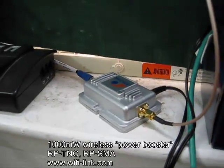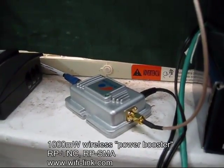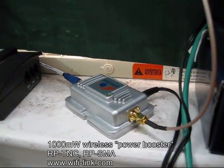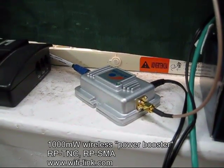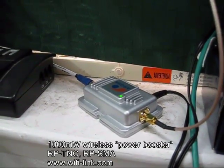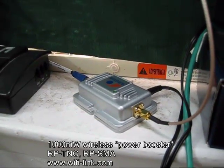You're not actually going to get 10 to 20 times the range, because the antenna produces a donut-shaped radiation pattern — it's three dimensional. The actual range that you're going to get from using this thing is the cube root of 10 to 20, so a little bit over two but less than three. It's a major improvement, but what this really does is increase the reliability of connections that are mid-distance. I can cover this entire complex right now with this amplifier and people are not getting dropped signals anymore — the reliability of the link within your average distance improves drastically.